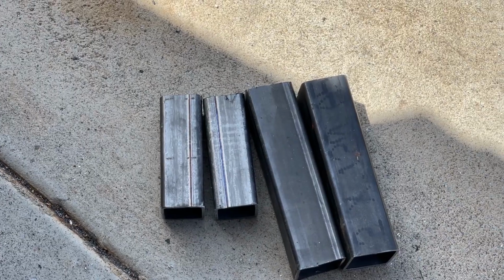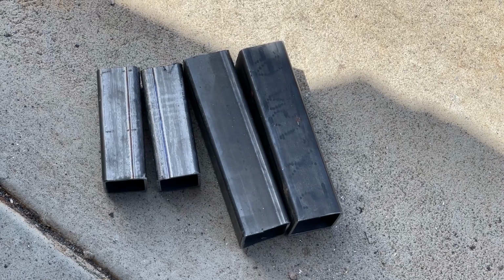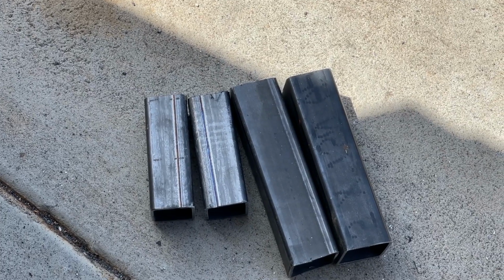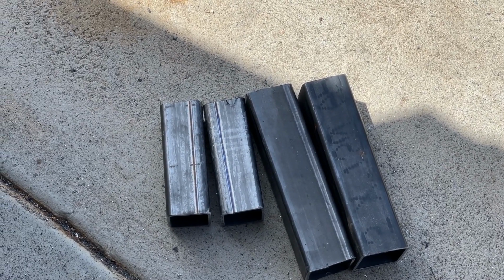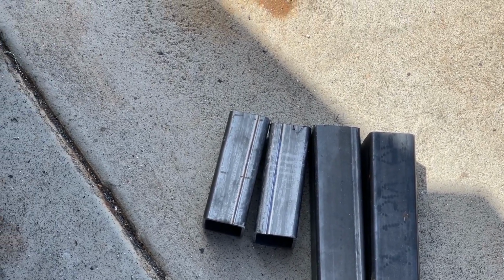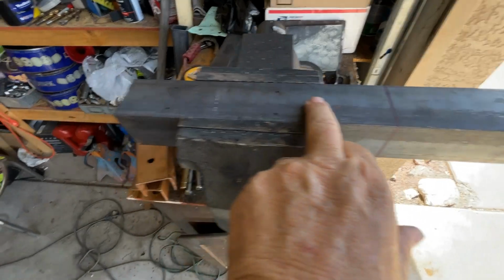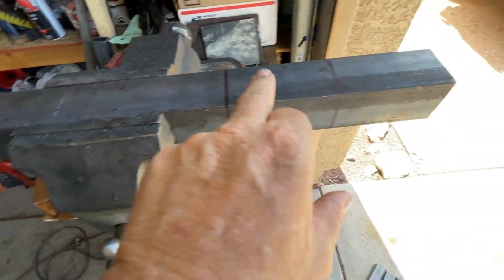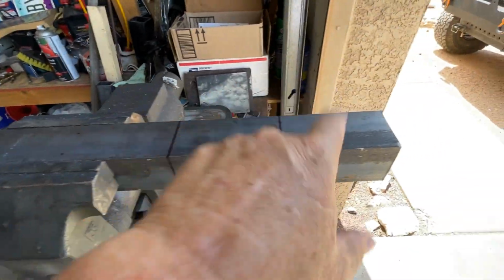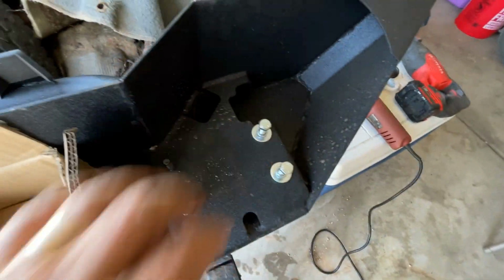We have 2 8-inch horn extensions, or frame extensions, out of 2x2 square tubing, 1/8-inch wall. Next to that are 2 horns that we're making for ourselves, and they are 1 3/4 square tubing, 1/8-inch wall thickness. Now we're going to make the ears that go onto the bumper, and that's right here. We're going to do 4 pieces of 2x2, 1/8-inch wall, 4 inches long, and they're going to go here. So we need 4 of them. Okay, all right, cool.